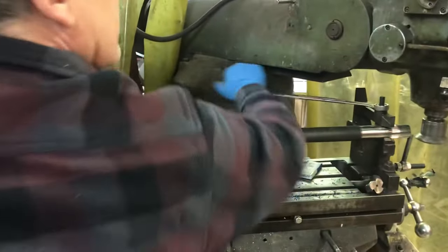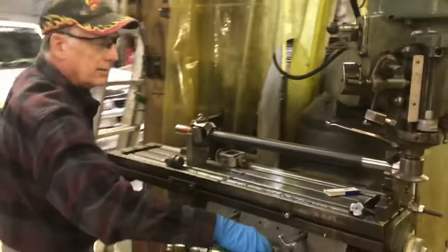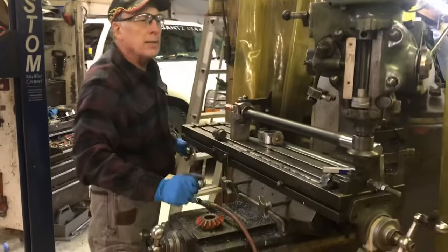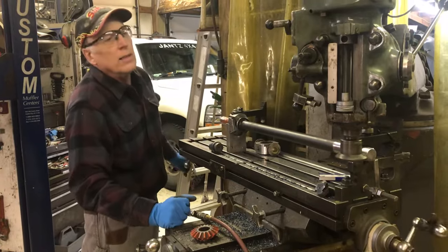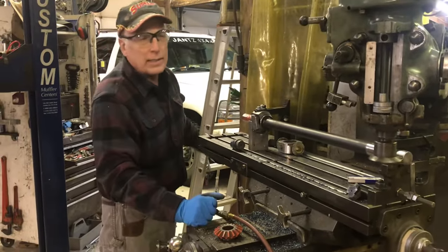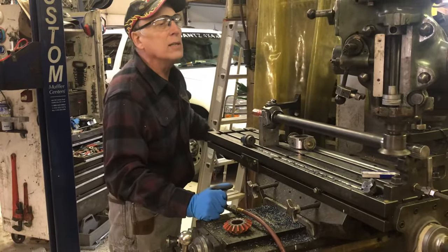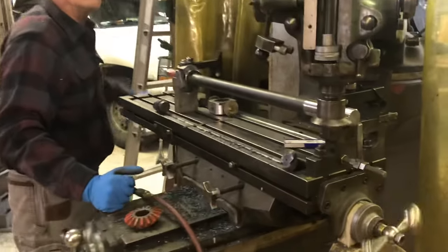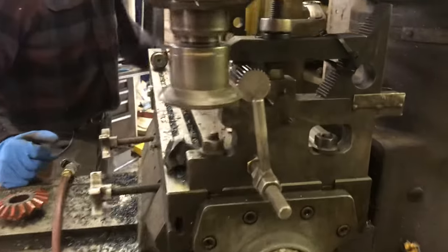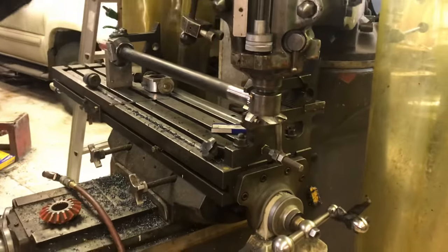Always pull this towards me, push the wrench away. Last spline — we'll pull it out. If we get it right, the side here will fit. And if we get it wrong, I'll just have to go around it again and dial this in a couple more thousandths. I've wiped it out, it should be good. But if you're machining along and things happen, there you go. That's the whole system. Let's shut this noisy thing off.